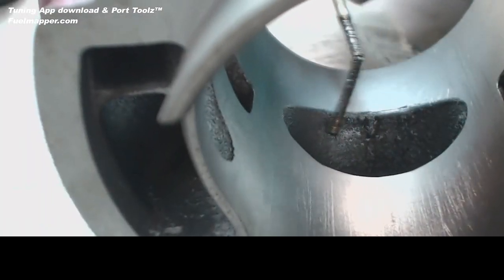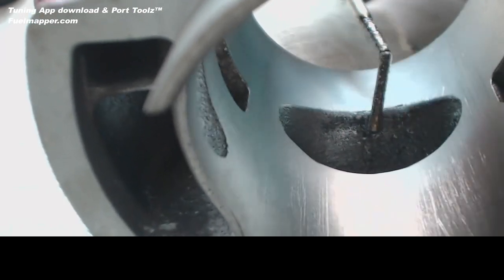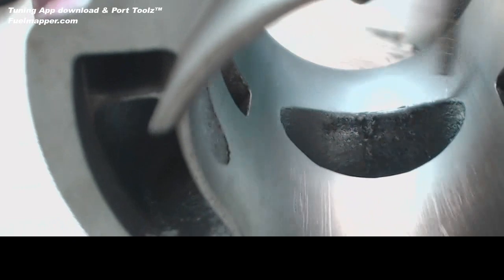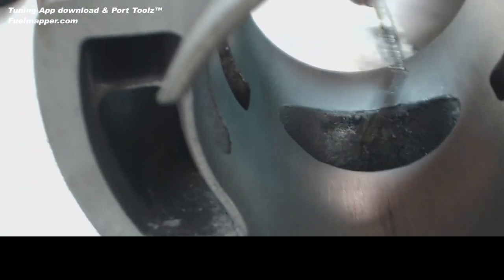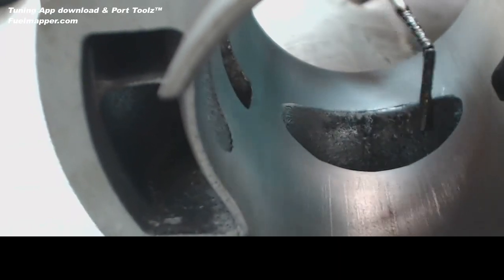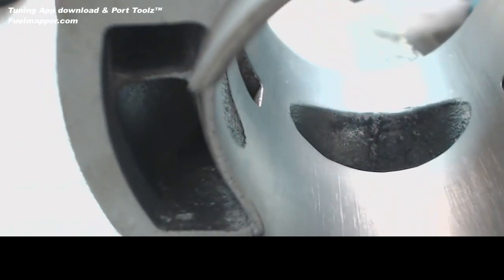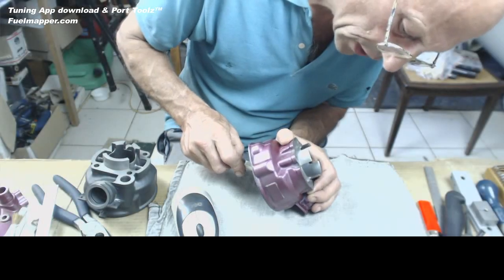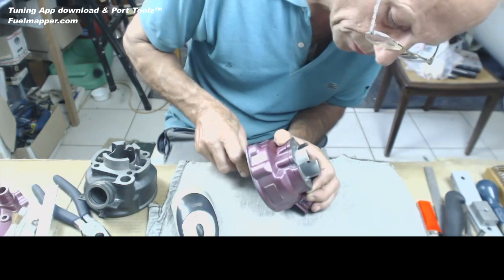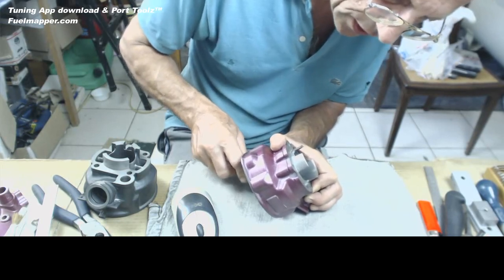What we're trying to do is just create a smooth surface so that we're then going to be able to build a chamfer on this edge. But our first task is to get rid of this rough casting. You can see how I'm doing it - it's supported and I'm looking down from above and working from below, and gradually - it's quite quick - creating a surface that we can then work with.